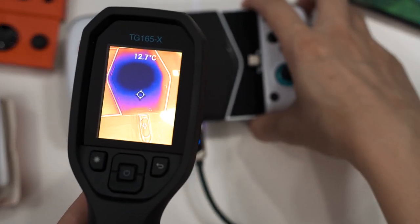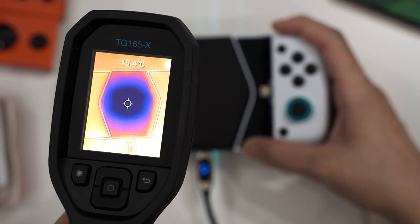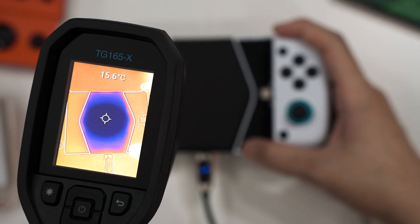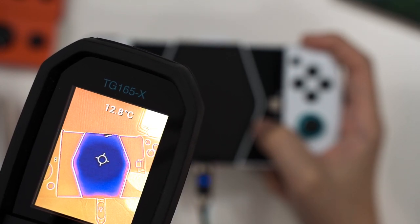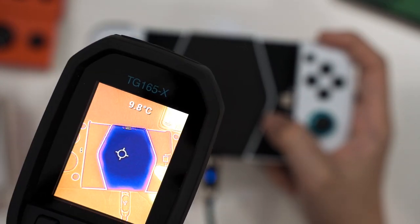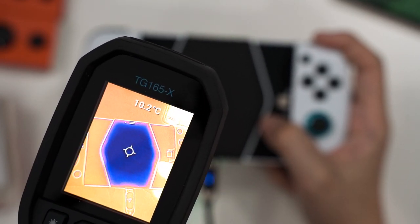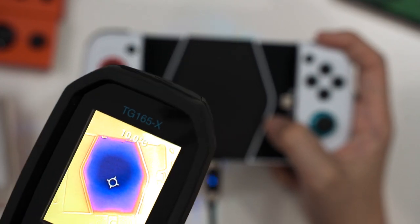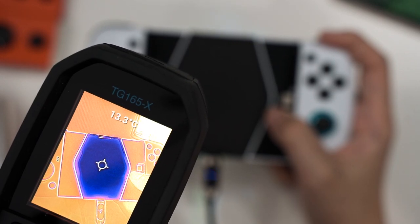Using the thermal camera, I can see the Peltier cooler works really fast — it reached a cool temperature of 15.7 degrees Celsius, then dropped below 14, then below 13, and it's now at about 12.5 degrees Celsius. It's now at 10 degrees Celsius — and it took less than a minute to reach this, which is amazing. It then dropped below 10 degrees Celsius, consuming 10 watts throughout.